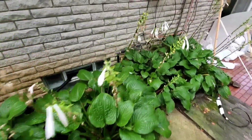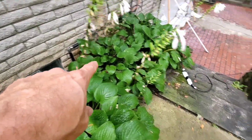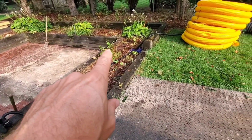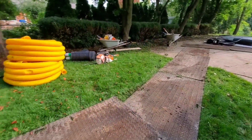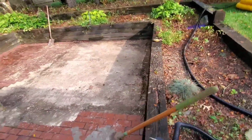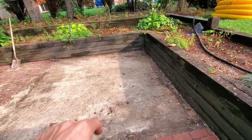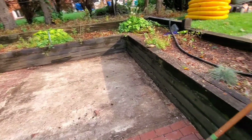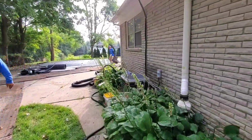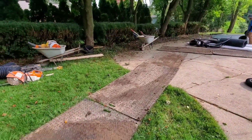All right, so the additional work he wants to do is there's the sump pump line there. We got to come out the house. We're going to come underneath the sidewalk, and we're going to kick it out to our outdoor pump, and then use that to pump it out over that way. We've got the materials to do it. We're safe there. This is all concrete, so we're going to have to break all this out, and he's going to have to get it replaced there. And then he wants to add this downspout into the mix as well, right here off the corner. Have to come along the bed and kick out that way.